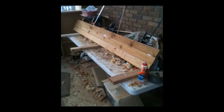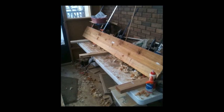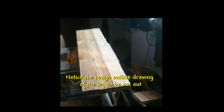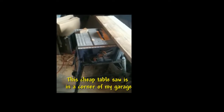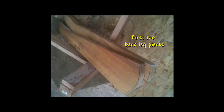This one here has been planed down mostly but isn't all done yet. I'm doing this one-handed so you'll see the chips coming up. What that does is shave off a very thin piece of wood to get down to the good wood. What I've got on the table is three cedar 2x4s that I've smoothed up a little bit and they're glue laminated together. These are going to be cut in half into two four-foot pieces and then custom cut to make the back legs.